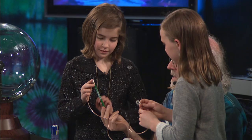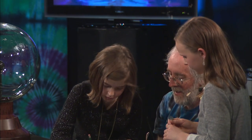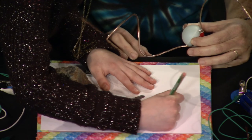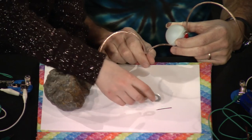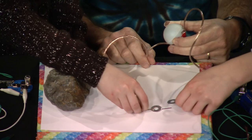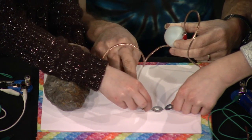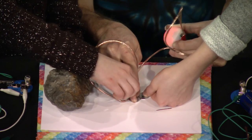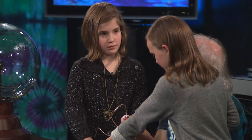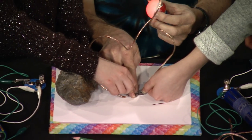Claire, go ahead and sketch us a skinny line and let's see what happens. Go ahead and take that washer and put it on this side; Madeline, put yours on the other side. The brush isn't touching the aluminum foil — it's got to be chubby. Back to the chubby one — and now we're getting a closed circuit. We're getting electricity conduction through the graphite, which is kind of cool. We just drew an electric circuit, and all the charges are moving inside there.